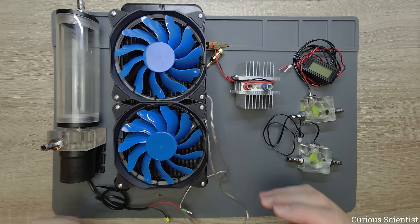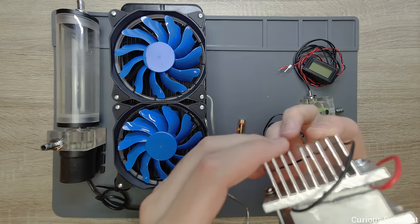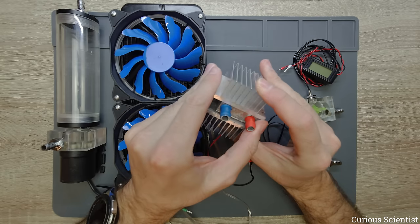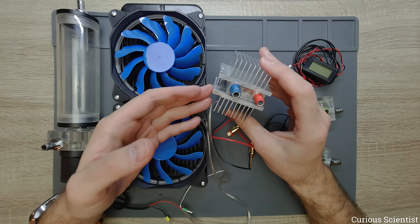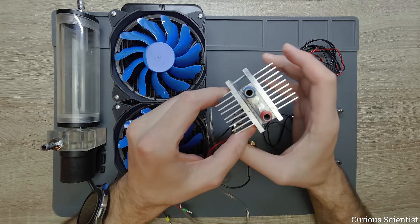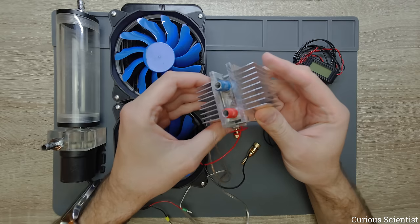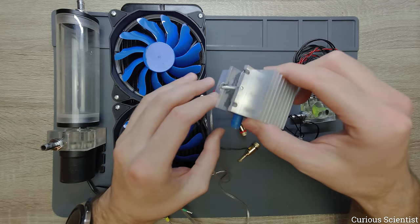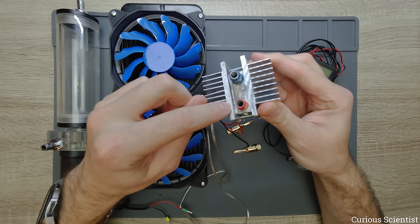At the time when I bought this kit it was around 75 to 80 US dollars, which was relatively cheap. What I did was use this to cool my Peltier coolers. The hot side of Peltier coolers requires cooling because that's where the rejected heat and the removed heat from the cold side ends up. So for example I put together this cooling block.